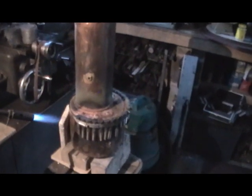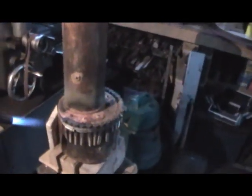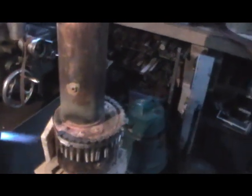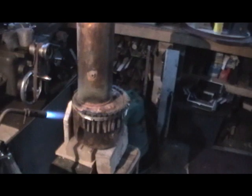As you can see around the boiler, I've clamped some bolts to use as a heat sink. I don't know if it's necessary or not, but I'm just belt and bracing it, just so I don't melt that outer ring of solder. And then I'm going to spot the stays with solder using my oxypropane, so I'll do that now.